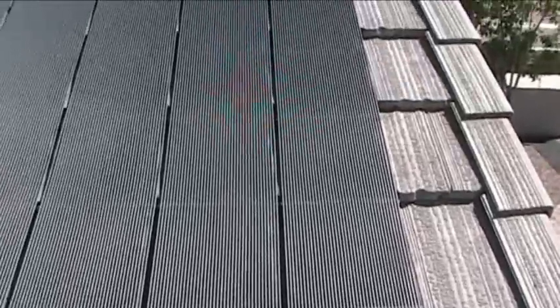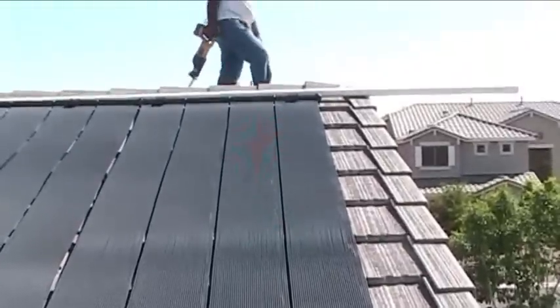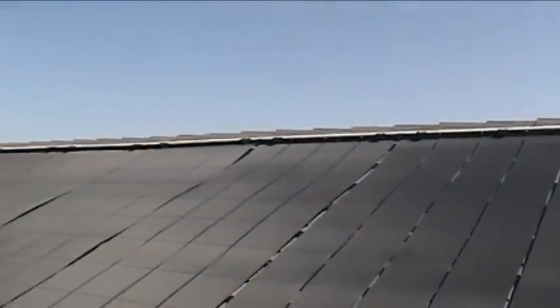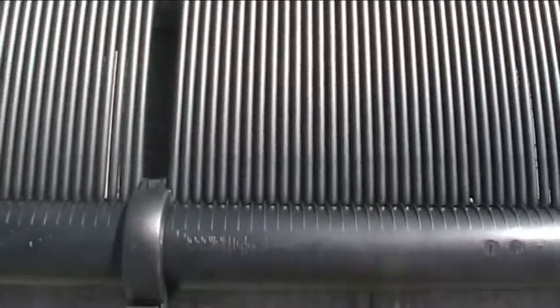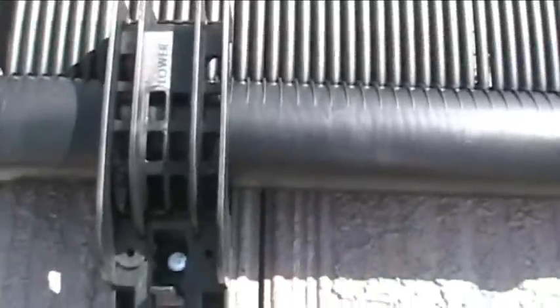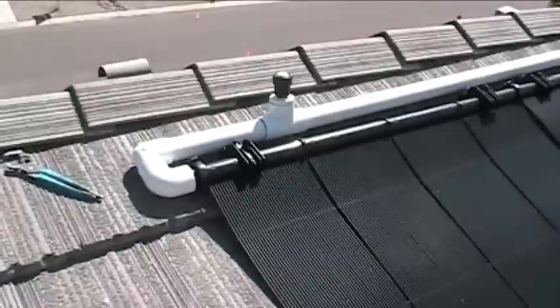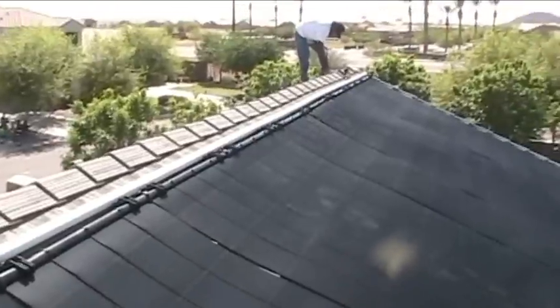Here's a good look at the south end of the solar panel installation. The water is going to flow into the bottom header, flow all the way across and up all of the small tubes to the upper collection header. At the far end of the header is where the return line comes back across the roof and down to the gas heater. Here are the specially designed clamps that hold the solar panels down to the roof itself, but they don't penetrate the actual roof structure — they tie onto the roof tiles with glue and a bolt so they don't penetrate the integrity of the roof.